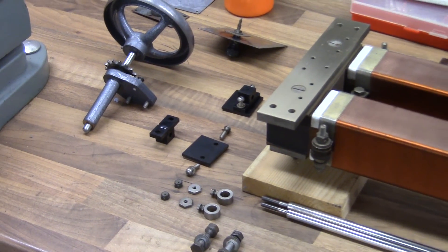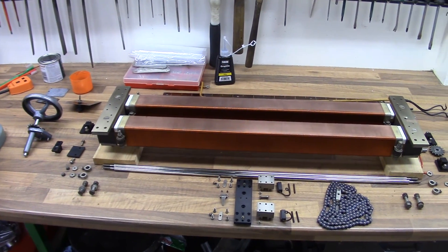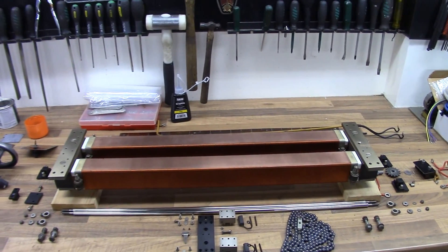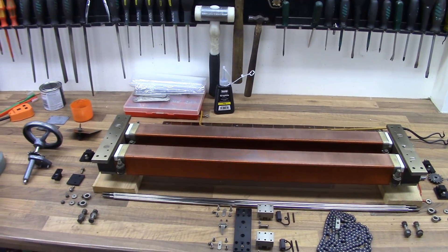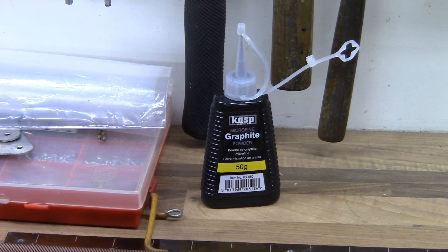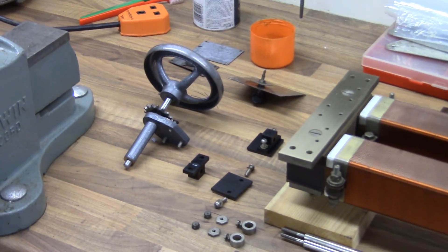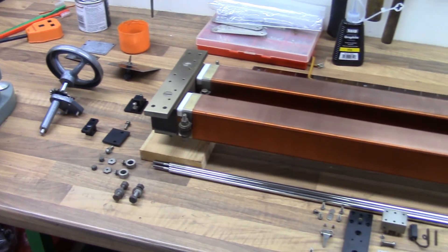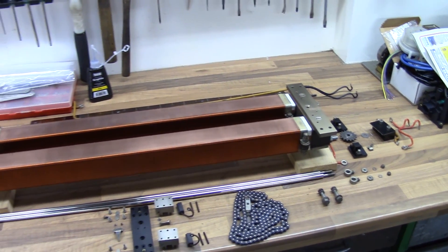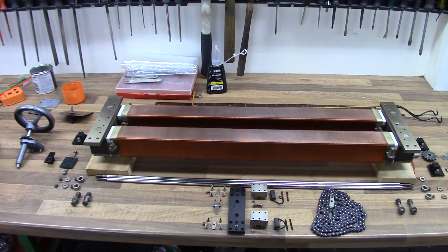There's not much stress on that component really. Afterwards it's just a matter of putting it all back together. I'm planning on using a dry lubricant instead of grease, like the previous person used — it's all gone gooey and sticky. So I'm actually using this graphite here, as John High Voltage Projects mentioned to use. I'm going to use that on the chain, the handle, and all the other moving parts like the rod assembly — it's all going to be graphited with a small amount of graphite, and that's all it needs. So it doesn't go all gooey like it was before and it stays dust free — nothing will stick onto it.